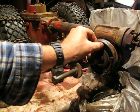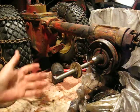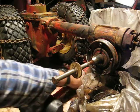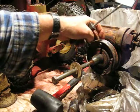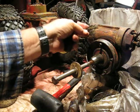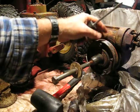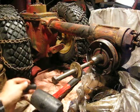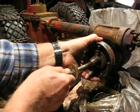You have these Allen head bolts and it's going to be pretty tight. I just used a rubber mallet and a cheap screwdriver, tapping a lot. There's a paper gasket in there that you're going to sacrifice anyway. You just keep tapping it, working it back and forth, and before you know it, it came right out. Here it is here.